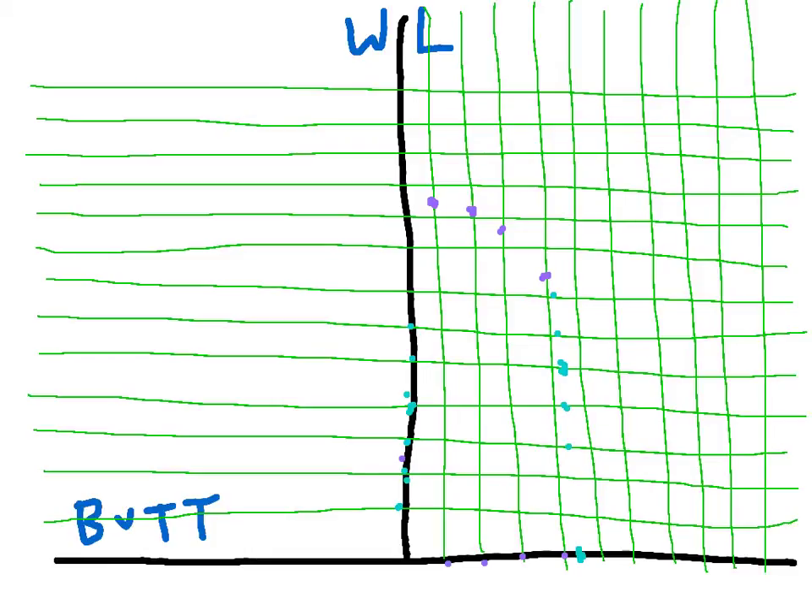For the sixteen-inch water line, I need to go out seven inches and three-eighths. Then for the eighteen-inch water line, I go over four inches and just over six-eighths — just over four and three-quarters inches. As you see these dots line up, you can definitely see something forming.